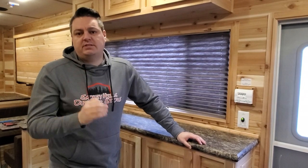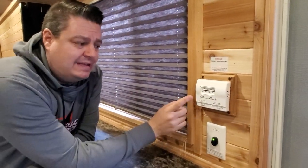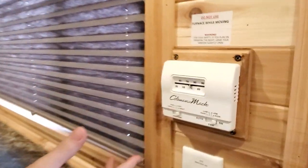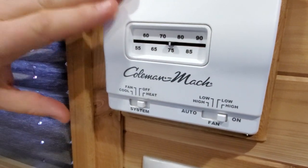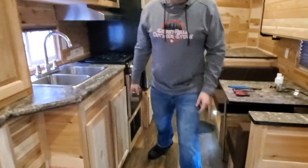The next three things I'm going to talk about are the three big ones. We've been doing this almost ten years and I've seen a lot of different things, and if you know these three things you can troubleshoot your furnace almost as well as what I can. We're going to start with the thermostat. Lots of different thermostats out there. When you turn on your thermostat, you want to make sure the fan on the furnace starts up. If I put it to heat and the fan kicks on, that means my thermostat is good.